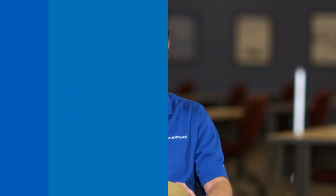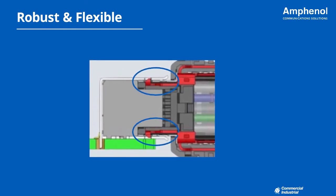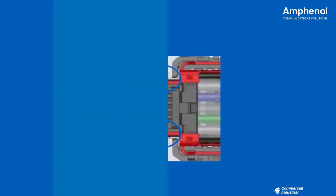With the category jack breaking — it's just not robust. It's a great solution, but wasn't necessarily optimized for industrial applications. When you think about the latch on a mod jack, you can snag it and break it. The whole jack in general can just be broken. So with the IX Industrial, we make it rugged so that there's not any sort of snagging with the latch.